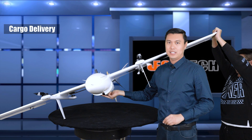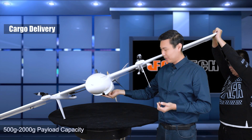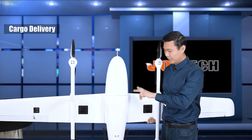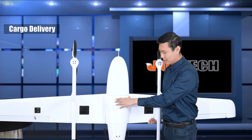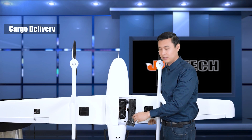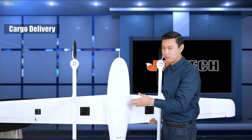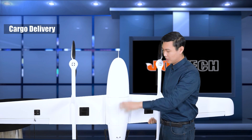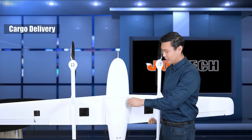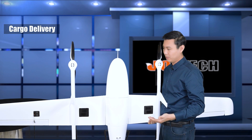For the delivery version of the Ike 250, the cargo bay can hold something fairly large — even a remotely controlled vehicle. The hatch door has an inner spring and lock system. Items are secured using inner servos, and whenever the plane reaches the destination it can be triggered automatically to drop the cargo — such as an autonomously running vehicle or emergency supplies. By the force of the spring, the hatch door returns to its place, and the plane takes off and flies back to the launch point by itself.